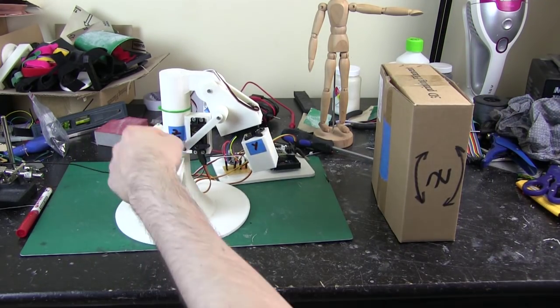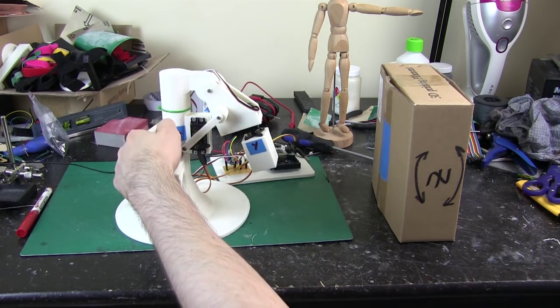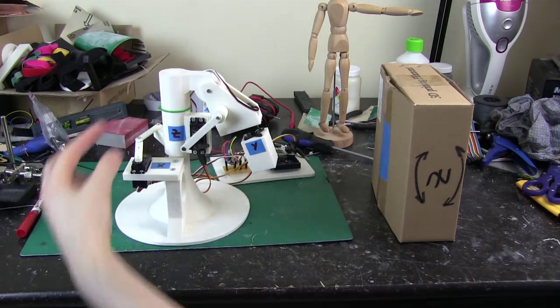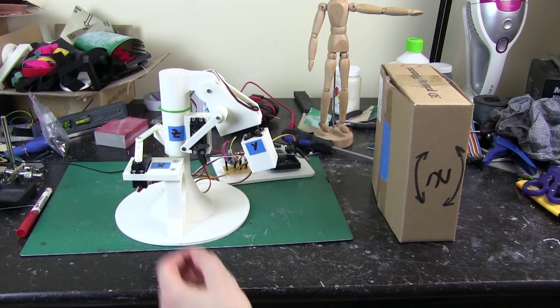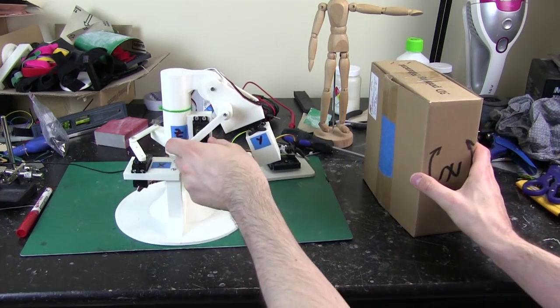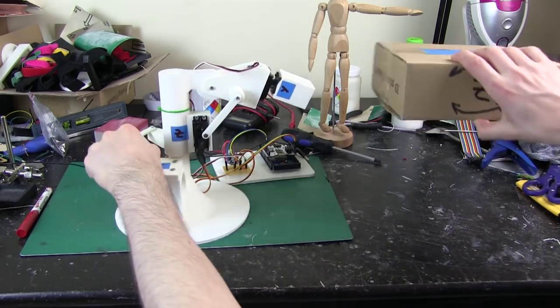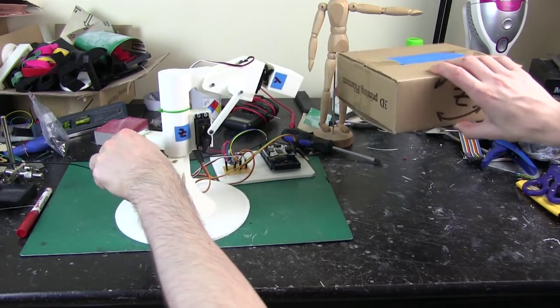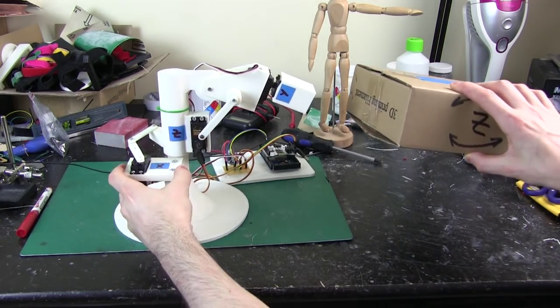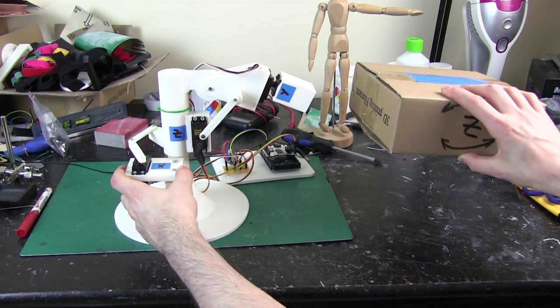Now this arm's laid out a bit funny, it's not particularly biological with the rotation axis being all the way over here. If it were directly above the shoulder, then that would be more humanoid, so it would actually rotate the arm instead of swinging it. And again, when the arm is out, then that's fine because it makes that motion of moving your arm in X still. So X always stays mechanically with rotation in space, basically. That's the aim of the design of this arm.